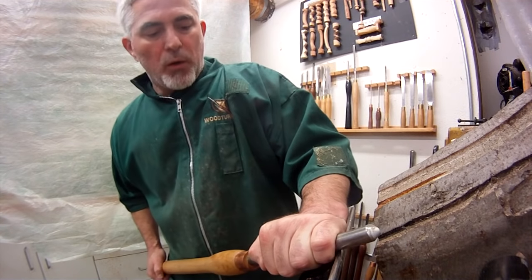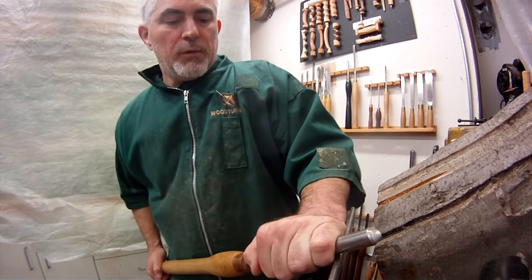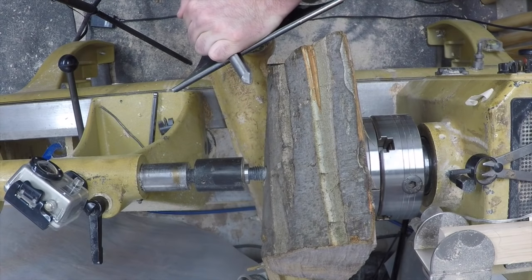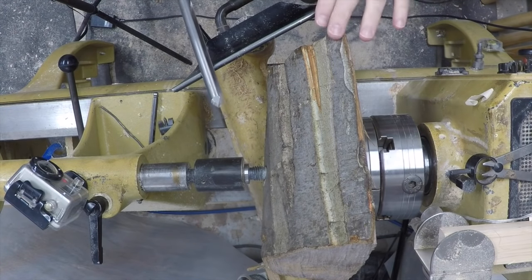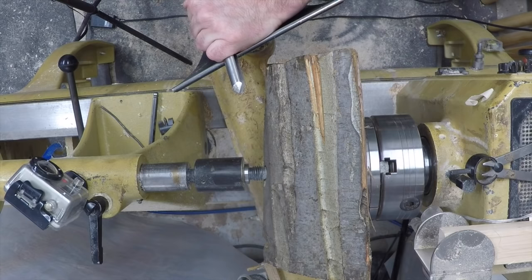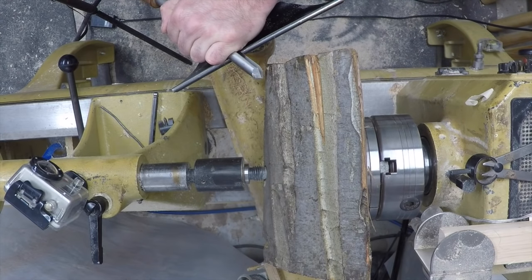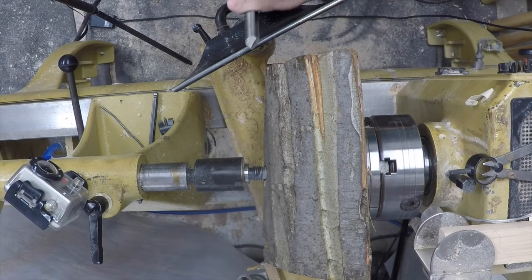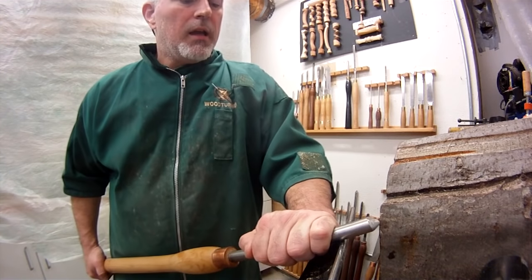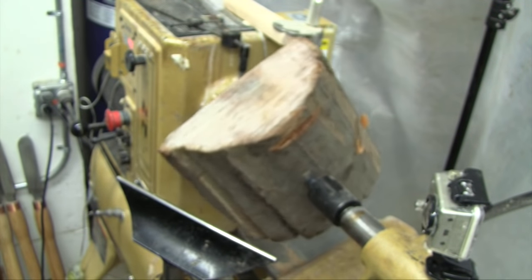Notice that I'm going to be using my whole body to move the tool — that's going to give me just that much more control. You can see what's happening now is the tip of that tool is making little arcing motions. The second most important thing when you're doing this cut is you want to start with the tool so it's not making contact, and as you pivot, it starts making contact, you're engaging the wood, it's cutting, and it'll stop cutting. At that point, you take away the tool, find a new spot, and start over — you've got another pivot point, you start arcing, cut, cut, cut, it stops cutting, and you just keep repeating that process until this becomes round enough that you can go back to the usual cross-end-grain cut.